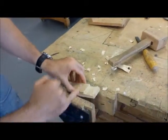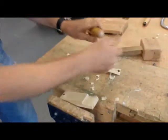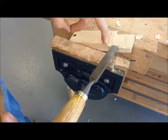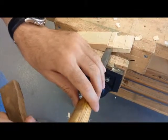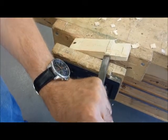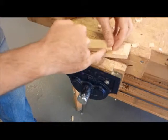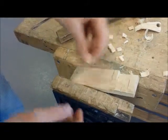The other way you can go wrong is if you haven't done your cut lines correctly. So you will notice that if you've got those cut lines in place and you put the chisel on this side, it will break that wood up to the grain, up to the cut, sorry. There we go, with the grain up to that cut line. However, on this one, I've deliberately cut this a bit short. You can see the issue, if you hit that side, or you haven't gone deep enough, and you come in like this, then you can see the problem. Okay, there was nothing to stop that splitting along the grain. I didn't realise I hadn't cut deep enough, and now I've cut and it's just split along the whole length.